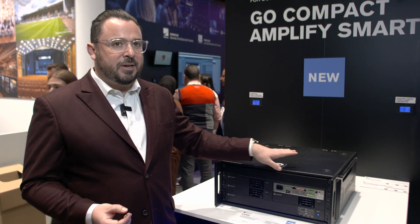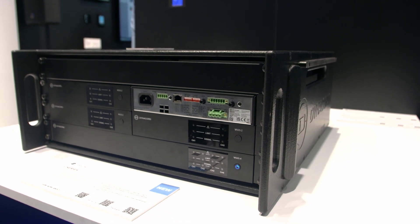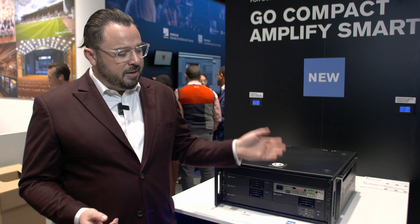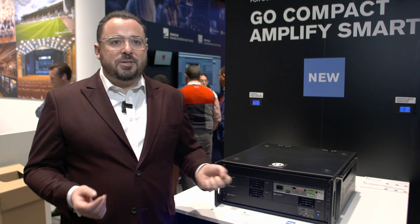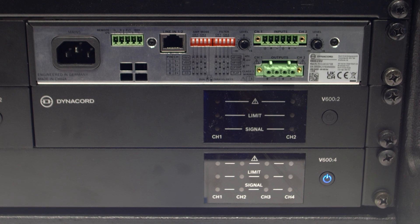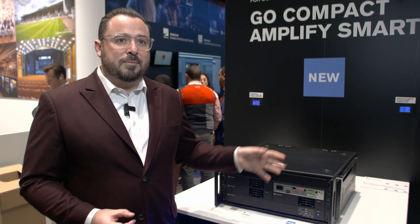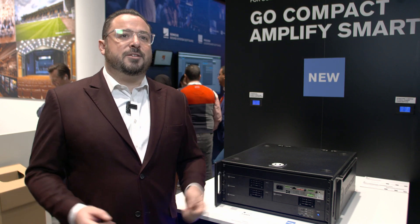All of the same robust features from the v604 — our Power Tank, which is a power sharing option, up to 600 watts can be shared out on a single channel. There are high-Z and low-Z options per channel, and DIP switch settings on the back for high and low pass filters. It's a robust yet simple product to power any kind of speakers you need.